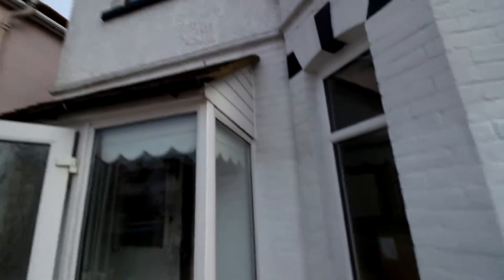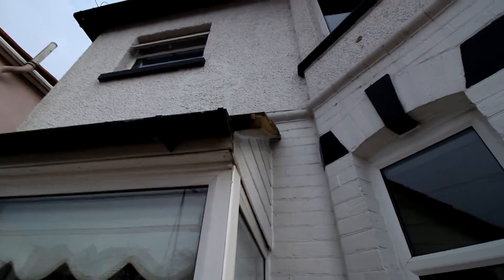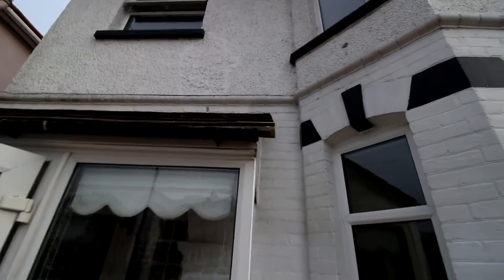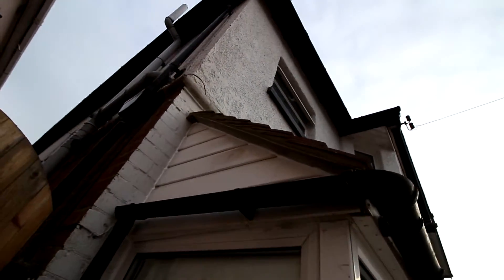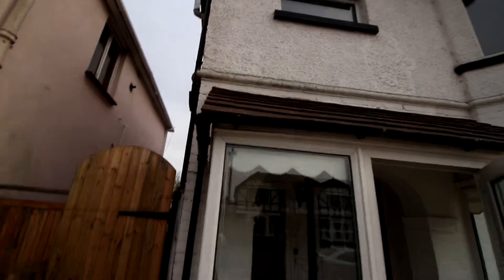Today has been porch roof repair. You can see we've got a nice overhang now, rather than before when it was flush with the side — which was no good because rain was just dripping straight into the porch. Now on either side there's a tent of tiles, some edging, and that's a beautiful job. It makes a massive difference — the rain is now going to hit the gutters rather than run down the sides.